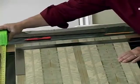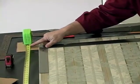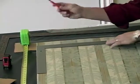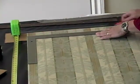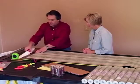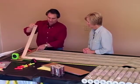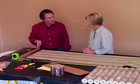Now, here's the height that we need of the master sheet. It is 9 feet, remember? 8 height plus 4, 9 feet. Now, what I'm going to do is take my knife. We have these snap-off blades, and we're just going to cut off the top really quickly, just come right along the edge, okay? Now, this automatically gives us a couple of things. It gives us the 2 inches above, and it automatically gives us a very squared end.